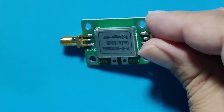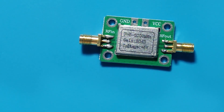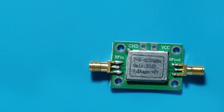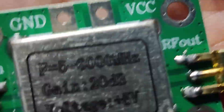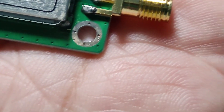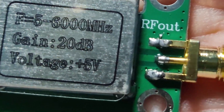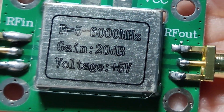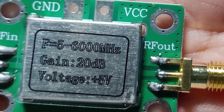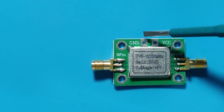This is the new version of this amplifier. It ranges from 5 MHz to 6000 MHz; its previous version was from 50 MHz to 4000 MHz. It is a 5-volt device. It can be used as an LNA or as an RF amplifier, meaning it can be used on the TX side or the RX side, but it cannot be used with a transceiver. Its gain is 20 dB and it has SMA connectors on both ends.